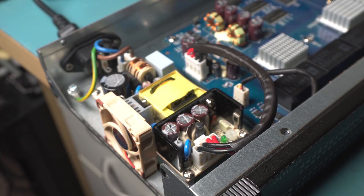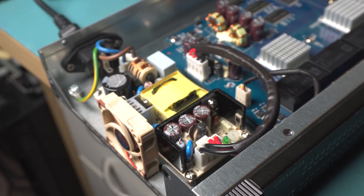That was a relatively simple mod and a pretty easy repair. Once I get those extra caps I'm going to swap those out too — I should probably do it with my 1900 series as well. I don't know if I'll put a fan in it seeing as the caps have survived all this time, but either way I'm going to replace the caps in both power supplies, just as a matter of course because they're such crappy capacitors.